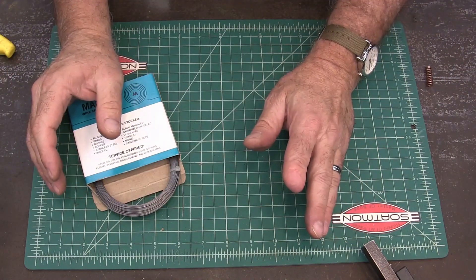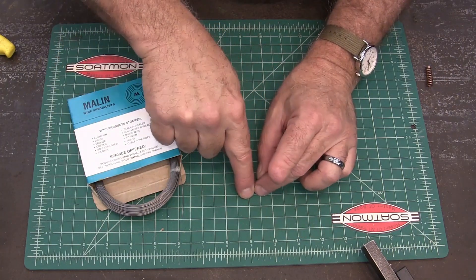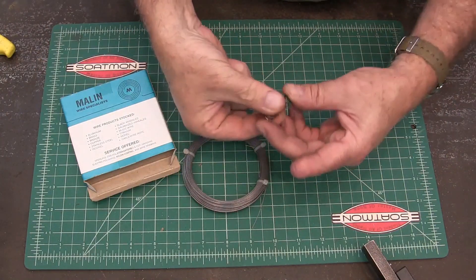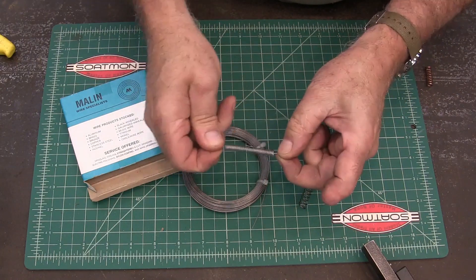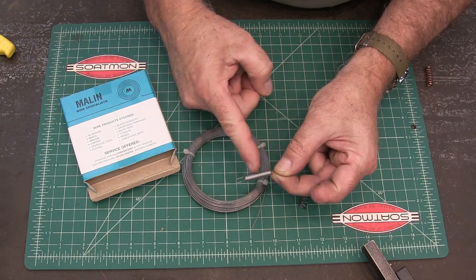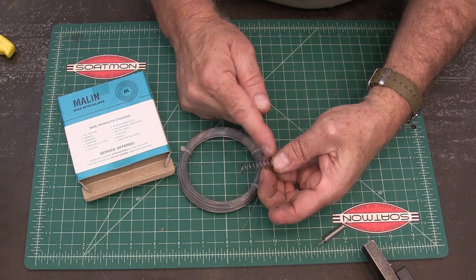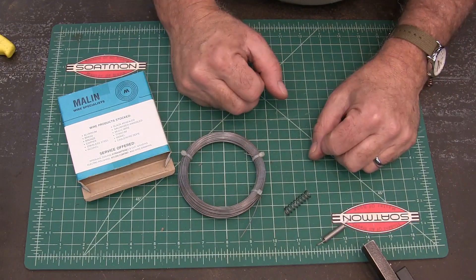I'm using a lathe to wind these but you can do it by hand, though then you've got to somehow time out how far apart you're going to put the coils. Today we're going to make a compression spring like this. You can also make just normal springs like that — this one just gets wound right up next to itself. For the spaced compression spring you're going to need a lathe or something in order to set the coils coming out spaced the same apart. Alright, let's get over to the lathe and get started.